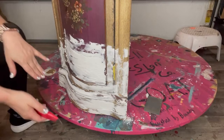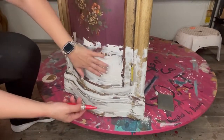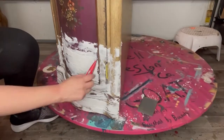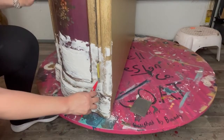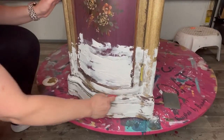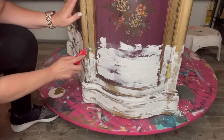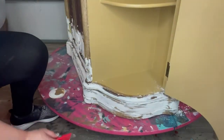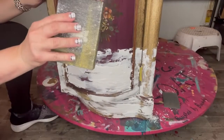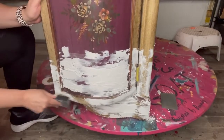All right, so our joint compound is dry, and now I'm gonna do some of the cleanup work. I went ahead and put some tape over my hinges. I decided I would do that so they don't get caked up with paint, and I can put some building wax on them afterwards. And now I'm gonna take my box cutter, and I'm just gonna cut around all of these edges to make sure that my door opens and closes, okay? And while it's open, I'm just gonna take a rough grit sandpaper block, and I'm gonna hit all of my edges.